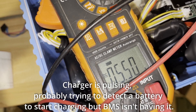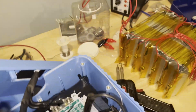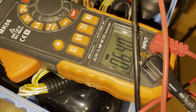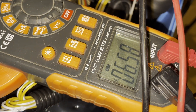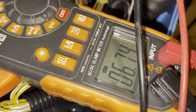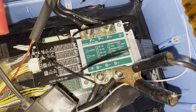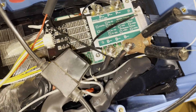Let's bypass the BMS and see what that does — go straight to the battery terminals. Okay, that's charging. Now of course this is without a BMS. Who knows, this thing might be salvageable. This will be an interesting test because some of these cells were down to 1.3 volts. So I'll slowly get this thing charged back up and see what kind of capacity it has after the fact. Not very cool that the BMS failed. I'm calling it the BMS failure because there would be no other reason — unless the balancer was trying to pull all the cells down and do a bottom balance, but it's a top balance board, not a bottom balancer.